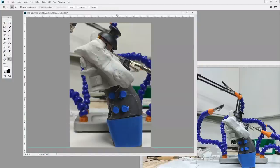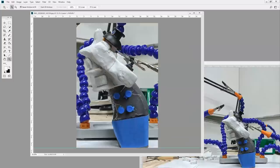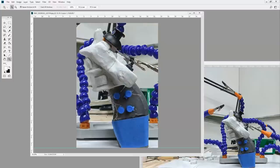Okay, so this is a photo I took close-up of the controller, physically close-up. And then I overlaid it with the distant shot. You can especially see the perspective change with those helping hands in the background. That's the distant shot, close up, distant, close up. You know, the lens is spherical, so it causes the image to bend. So actually, the further away you are from something, the flatter the resulting image will be. So I'll probably use this one. So I'm interested in this angle there, this angle, this angle, and that angle.